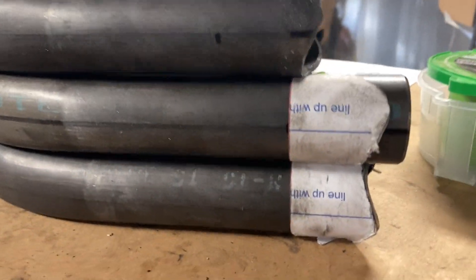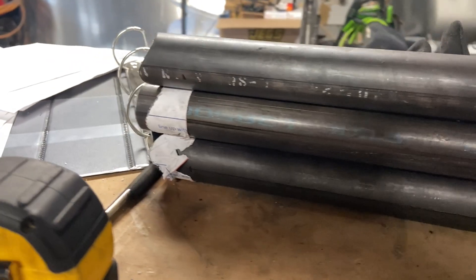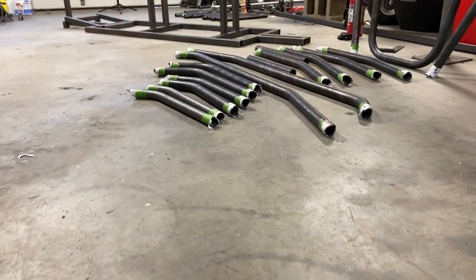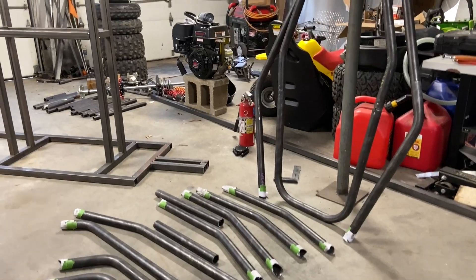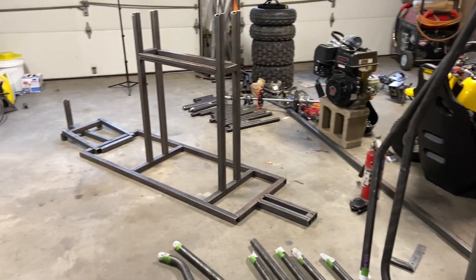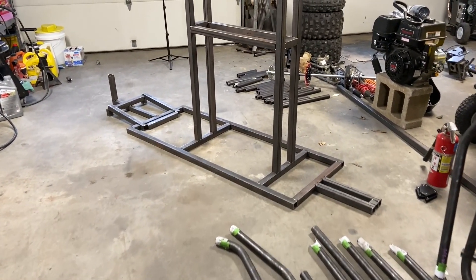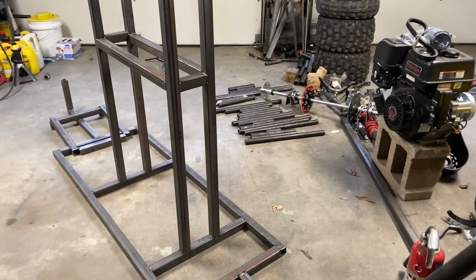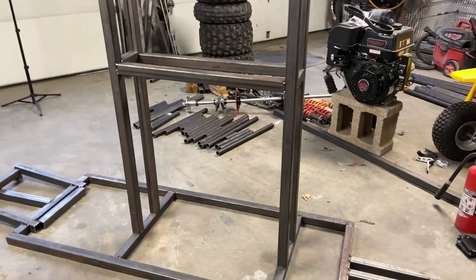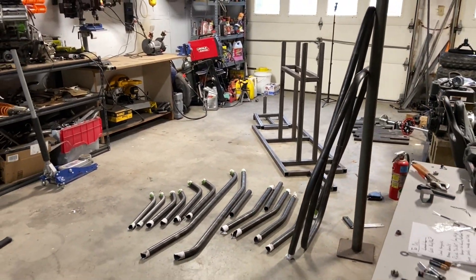Here's the bad piece, the re-bent piece, and the good piece — everything's lined up and it matches the measurements. I'm still not sure where I went wrong but it's fixed and didn't take long at all. After just a couple of days of work we've got all our tubing bent, the main pieces notched, and our jig made. The next step is to start fitting these pieces onto the jig for the main chassis. I haven't notched the cross members yet because I'm too excited to get this on the jig — the cross members go in after the main chassis is built. See you guys next time.